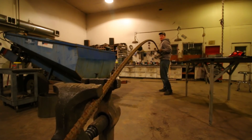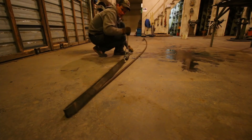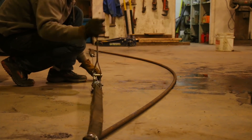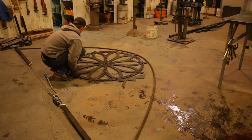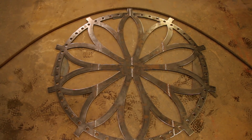The big vise didn't even give me enough leverage. Then I had the idea to use a come-along attached to both sides to ratchet it together, turning the rebar into the world's largest longbow, fit for Apollo himself. I kept tightening it until the bend matched the top of the reel, and then I went ahead and welded that section.